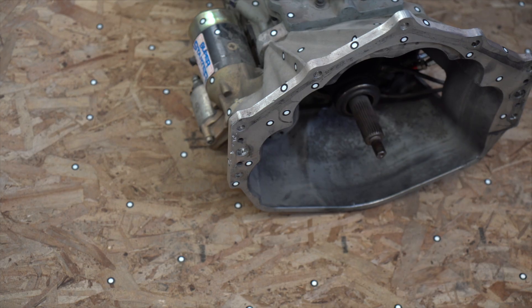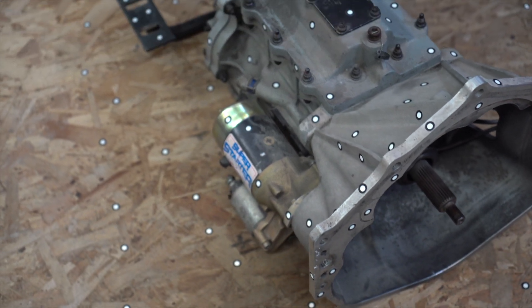We're going to target up our GSR and probably just do it right on the ground. I'll have to flip the transmission and scan the underside and then the top. I can delete all the targets off the ground, flip it, and then it'll pick them up as new targets. That gives me a GSR scan to use at my disposal for whatever I may need down the road. The more stuff you scan - as long as you're keeping it on an external hard drive - you really can't scan too many things.